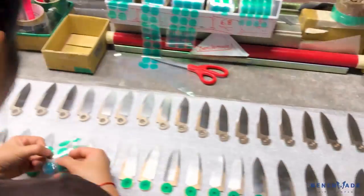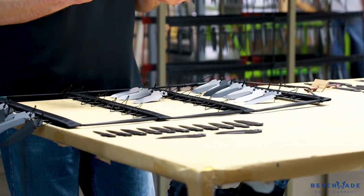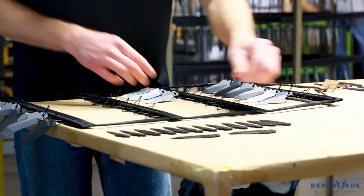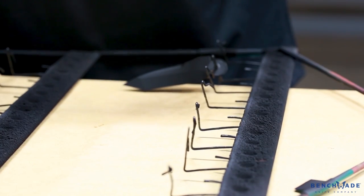The most important part about applying any coating is pre-treatment and the preparation of the part prior to going to the coating stage. If you don't have a good clean prepared part, your coating will fail.